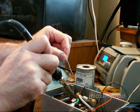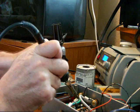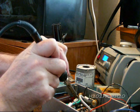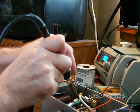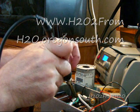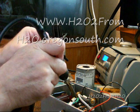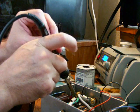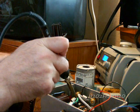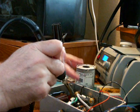And now you see why I wrapped the cell negative onto that R12 and soldered it, because as I heat this, you're really unsure whether that joint is going to be consistent. It's taking a lot longer, and even the case is getting hot.